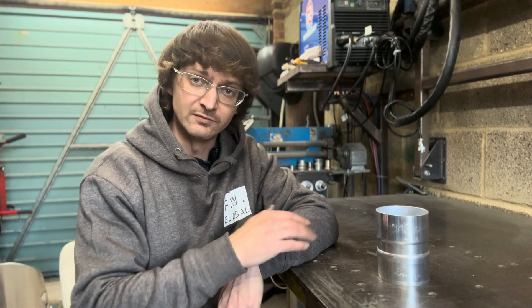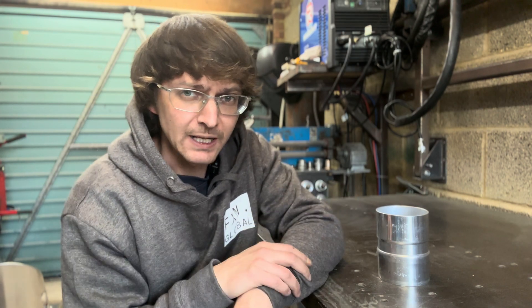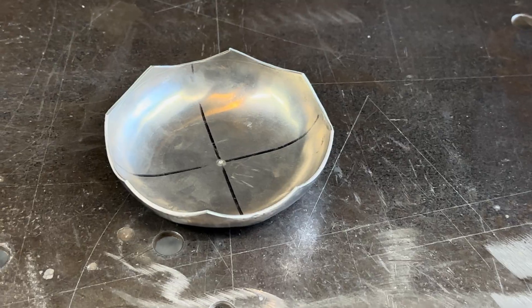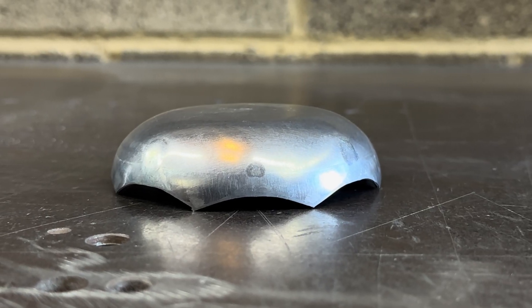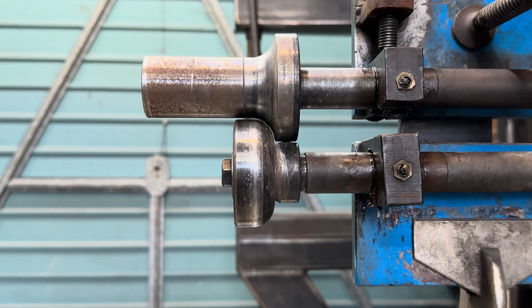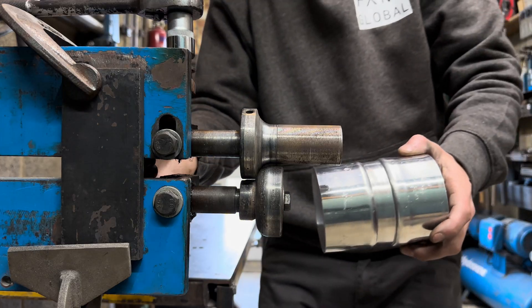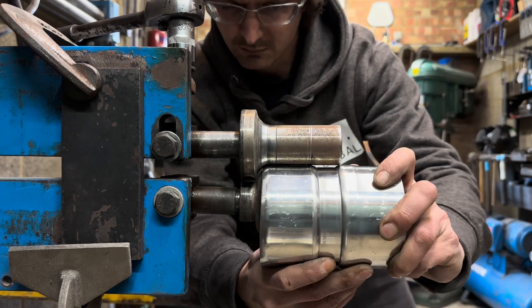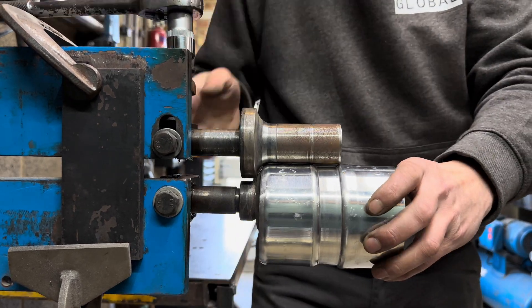With our main body now cut and formed, we need to decide on how to cap these off. We could be boring and simply put a flat plate on, but we're not about that — we're going to use domed caps instead. I'll be showing you guys two different ways to make these: one is the hard way and one is the smart way. But before we get to that, this needs to go back into the bead former, where we'll be using the aptly named tank rolls. This set of tooling forms a radius around each end of the tank body, creating a smooth intersection for the domed caps.